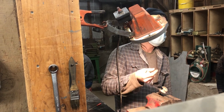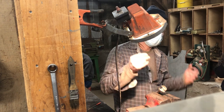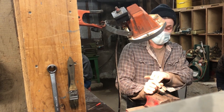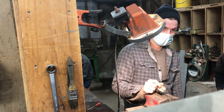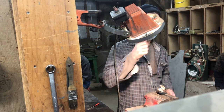If you've used a countersink that's a whisker bigger, and it's your own bung cutter or whatever, then by all means modify as you see fit, because you can change them to make a larger bung. But you have to know that that's what you're doing. Otherwise you're going to be like, shit, none of these bungs fit, you know? Yes.